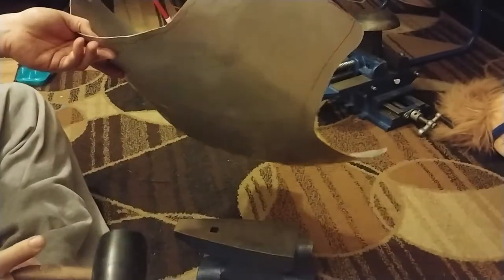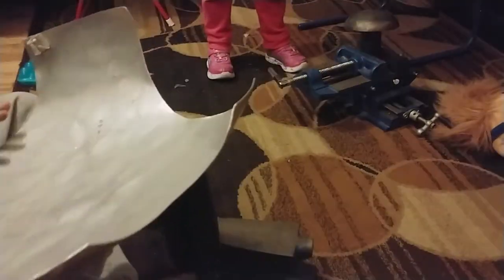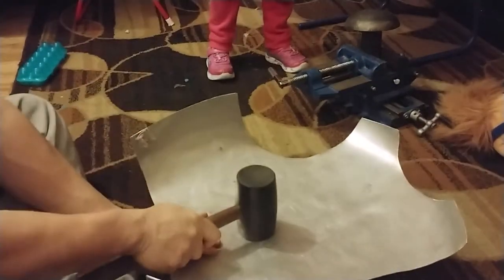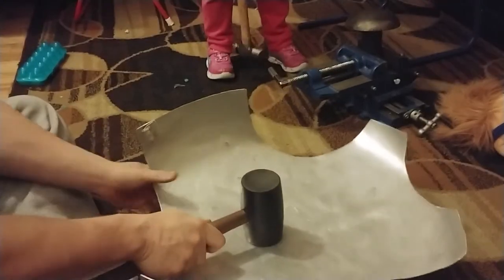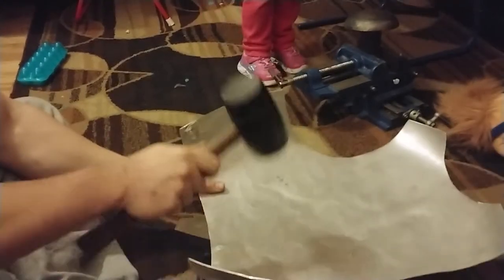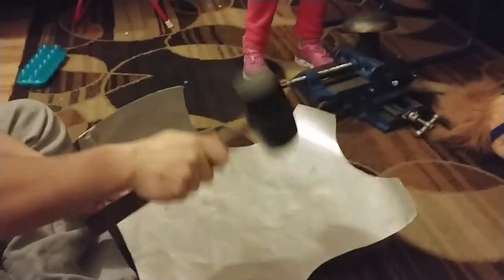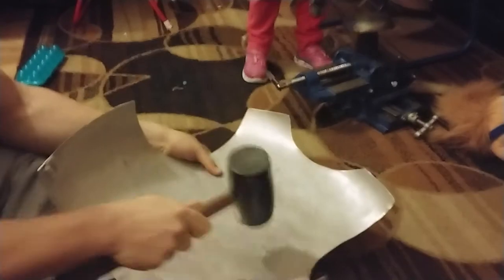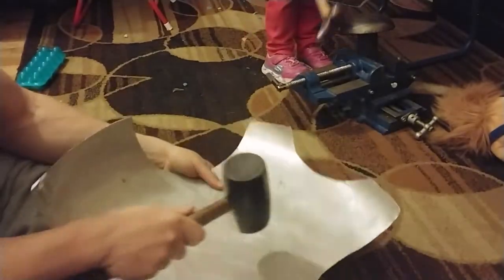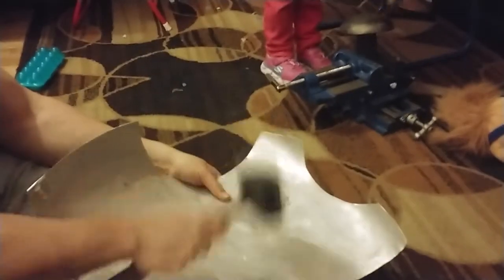When the bang gets loudest, that's when you actually know that you're bending metal, because when it's flat against the metal and you hit the hammer flat, you're just staying flat on flat. That's not really accomplishing anything. So you can tell from the sound if you're moving metal or not. If it's bouncing around in your hands, you're probably manipulating the metal.